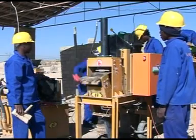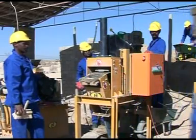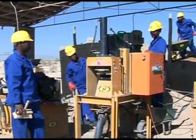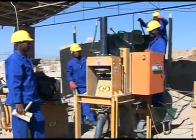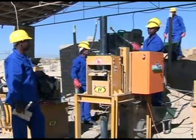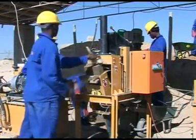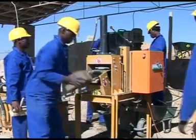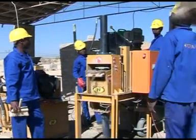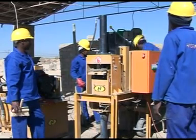The Hydroform automatic A2 and A3 block machines are less labour intensive and run automatically. No manual labour is required to load the chamber or control the hydraulic levers. The machine's hydraulics are operated electronically, compressing and then ejecting the blocks. These machines are ideal for permanent block yards where labour costs are higher. A block can be produced every 14 seconds.